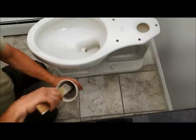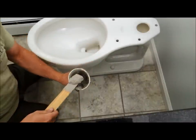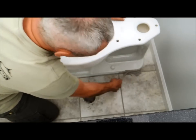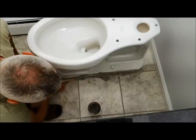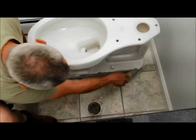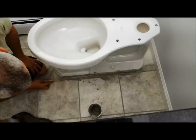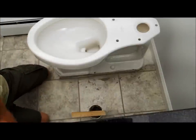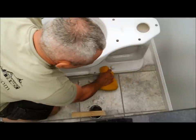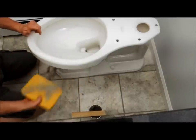In this case I am going to grout the base. I've mixed up a little bit of the grout that I used on the tile in a cup here, and I'm just using a wooden shim — it doesn't really matter what you use. Just like when I grout, I'm going to smoosh it in there. But I'm not going to put so much in there that I can never get this toilet off — just enough to cover the edge and give it a little extra support. I just want to cover that gap. As long as you don't put too much on there, you'll be able to get this toilet back off and scrape off the grout if you ever have to put a different toilet on. Then just like when I grout, I've got my clean water and my grouting sponge and I'll wipe that down nice and clean. This will help hold those shims in place as well as provide a little extra support.